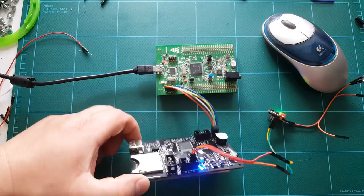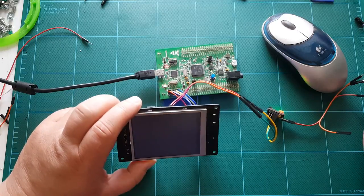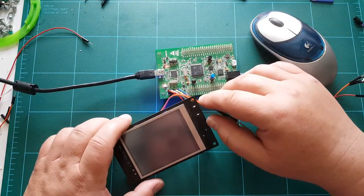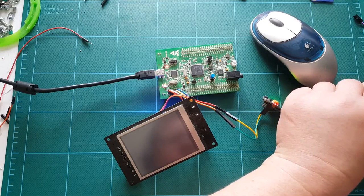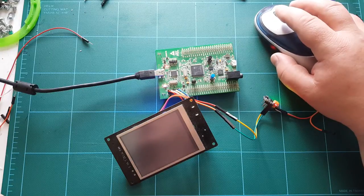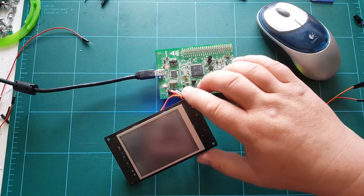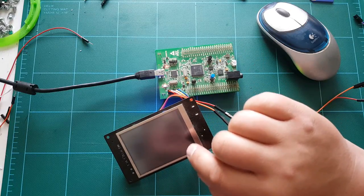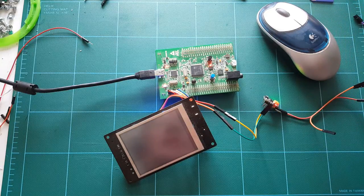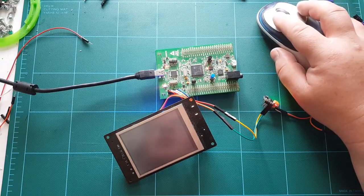It's flashed. Let's look at the screen and see if I totally broke this thing or maybe revived it. So far nothing - now it won't even boot. I guess this firmware wasn't meant to be burnt like that. The thing is, this board has a bootloader - that thing that displays the booting message gets started first, then it looks at the SD card for new firmware. I'm thinking I just replaced the bootloader with the wrong firmware.